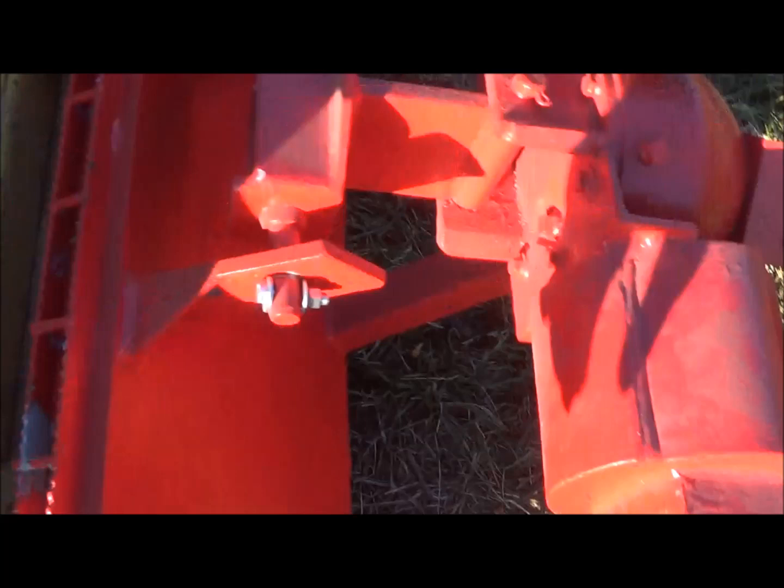My arrangement for hoses here — I need to get these tightened up, that one's got a little leak and that one does too, but we'll get that fixed. Just some flat-face couplers, half-inch NPT crimp-on fittings for these hoses I had made. With most of these projects, the hoses are almost always the most expensive part — I think I spent about 300, maybe 350 dollars on just hoses.